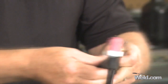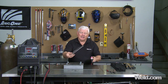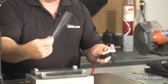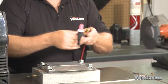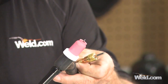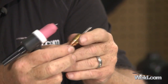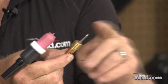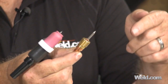For instance, if I were welding this 16-gauge material — and let's simulate this as a water irrigation pipe, it's about 16 or 18-gauge — we're going to replace this 1/16th diameter tungsten with a much larger, gargantuan tungsten. We need that large tungsten. Now, we're going to have an arc initiation, and if your machine has arc start, great. If not, scratch start.